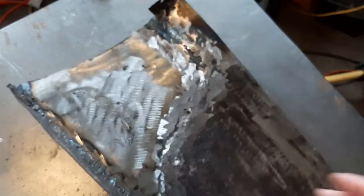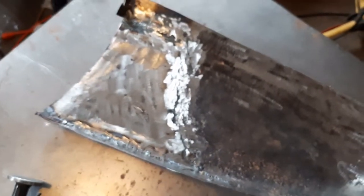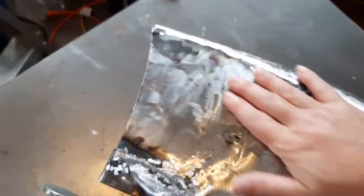That's where we're at. And when I run a dry fit, it actually still fits. You get the idea. Anyway, the shiny bits make it look like it's proud. I'm going to run this thing through an English wheel loosely just to planish it before I attach it. That'll give me a nice curve. And then I'm going to use this side to set up a cardboard template for the other side. There's a tiny little pinhole up there that I'm going to fix.